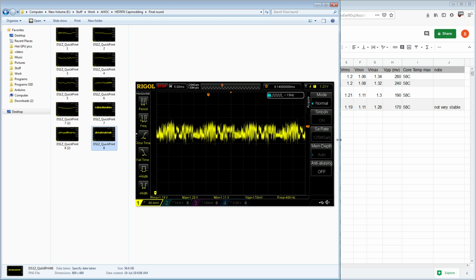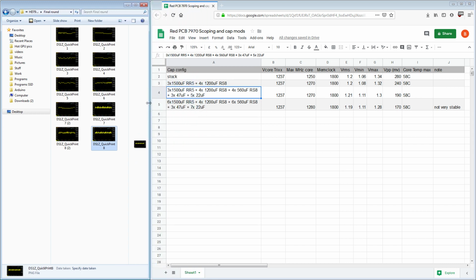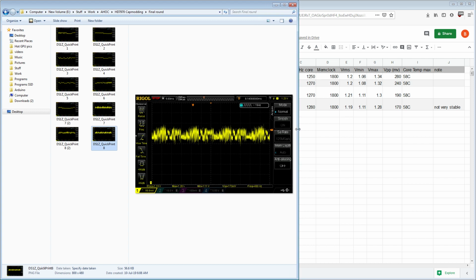So I really want to mess with this on a low end motherboard that has LLC settings. Because then you would start with a relatively normal LLC setting, and if you have a really big disgusting mess, you start adding capacitors until it cleans up, then you adjust the LLC upwards and start adding capacitors again until it cleans up. In theory, I want to see how far I could push it doing that kind of test procedure. I might even try that on the Maximus 11G. I'm just not sure. I think that motherboard shouldn't benefit from extra capacitors, because that board's meant for extreme overclocking.